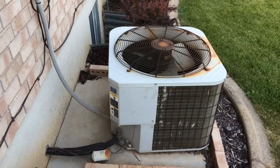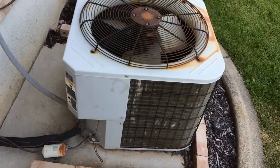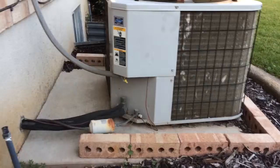So here's the outdoor chunk of it. This is the air conditioning unit here. We're going to do a surge protector up here in the disconnect, replace the disconnect. Line sets are very, very easy — comes right in through the side of the wall. Set a new condensing unit, going to be a lot larger obviously this time. One thing though on this is the pad — it is a cement pad and it's not level, so we are going to do a new pad. We can bust out this cement and get rid of it.